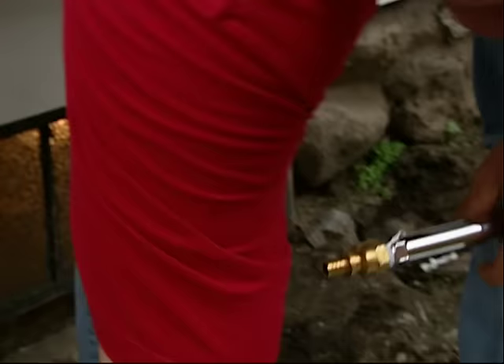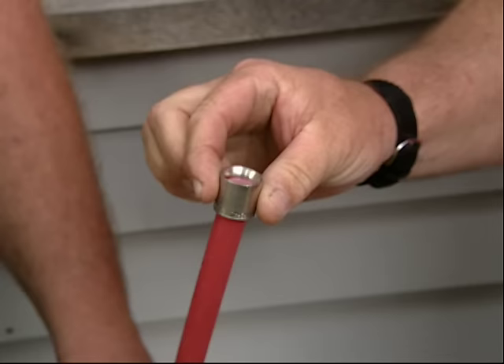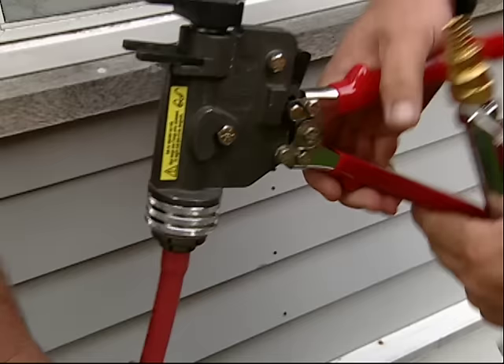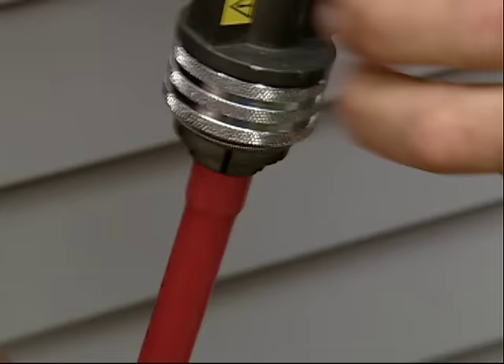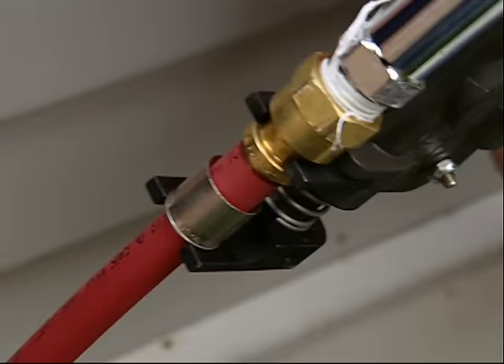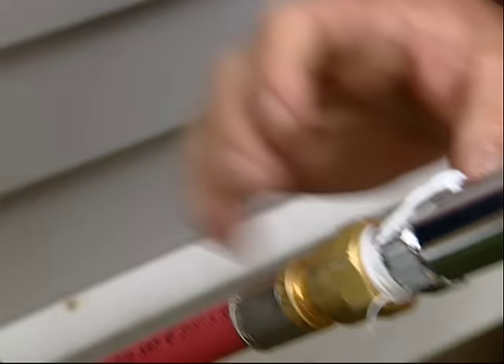The connection between this and the PEX is pretty interesting. What's nice about this PEX is it's flexible — you can work on it any way you want. There's a sleeve that goes on first. Now we're going to expand this pipe — this tool will actually expand the PEX to a larger inside diameter. Now this fitting will fit inside. Bring the sleeve back up and with the opposite side of the tool — that will never ever leak.